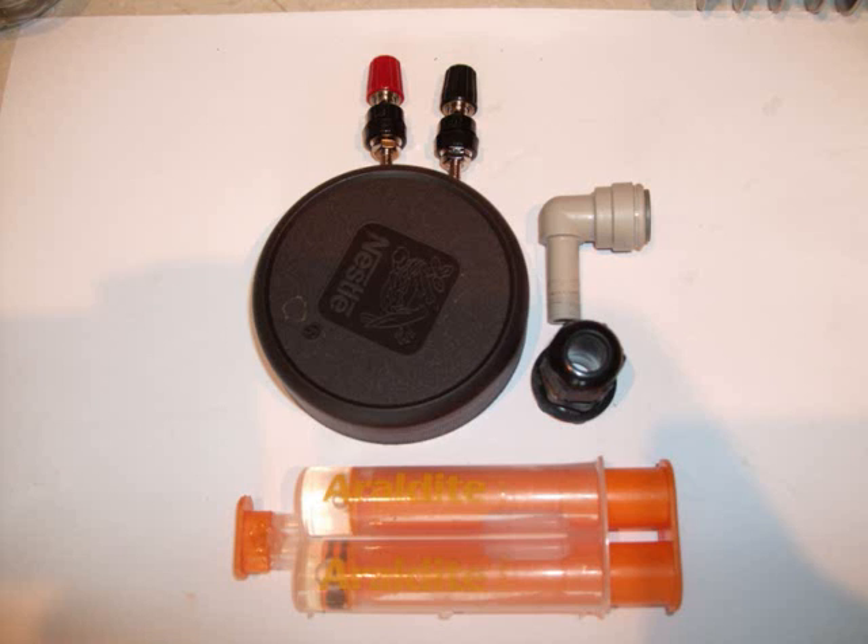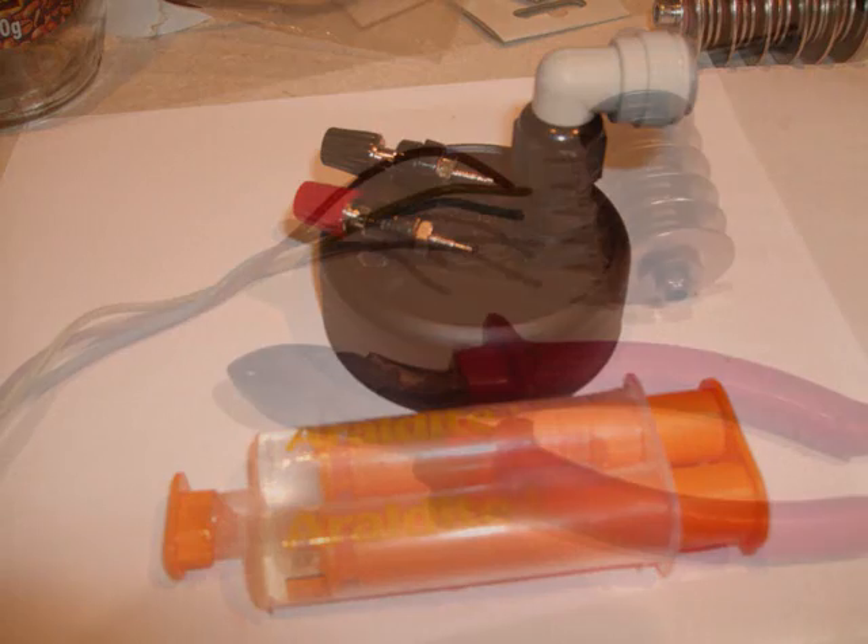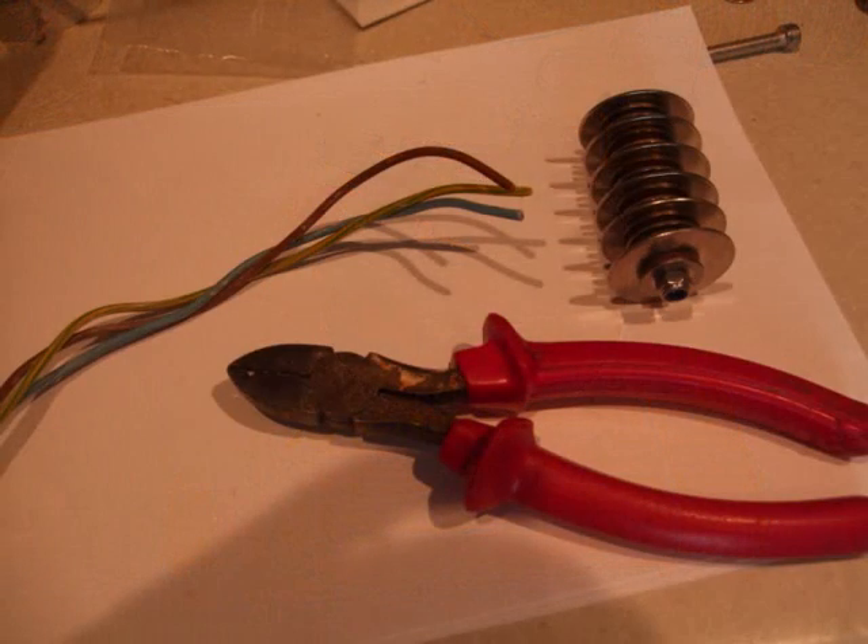This is the new lid which will have the electrical terminals and the exit pipe surface mount fittings drilled and screwed and glued into place. Using araldite glue as it sets hard creating a good airtight fitting. For the preparation of cables strip back the 2mm cable sleeving, twist together the stranded cable then solder all the way down. Make sure you get good solder joints to the inside of the lid connection terminals as good contacts are important. I found it a little tricky because it takes a lot of heat to melt the solder on the terminals and the cables together — in the end I used two soldering irons. Make sure to tin the terminals first; this means to melt some solder onto the terminals before soldering the final connection. You will find that the solder will bond more easily.